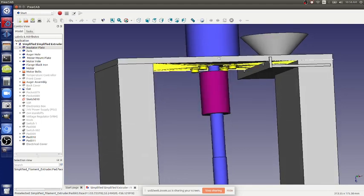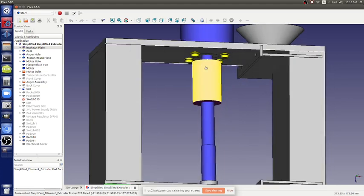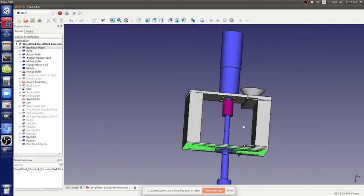So mount the motor. Yeah, we could use that motor that we have that works. We know it works. So coupler to it. It's got a keyway on it. So a half inch coupler, and then weld the socket so we can grab onto the hex of the one inch auger. So that's the idea here.